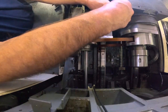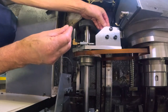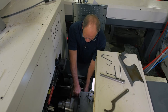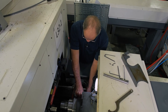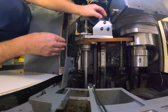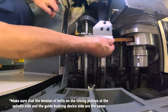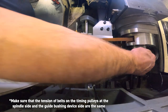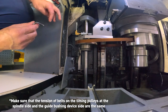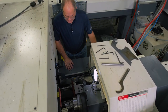Tighten up the jack shaft itself — rotate, looks good, it was tight. Snug down the two remaining bolts. If for some reason the stop block got moved, you would place a mag-based indicator on it, get it straight again, then pull the drive shaft back up against it. Tension's good — that's where it was when we started, no binding. We're all set with this end of the machine.